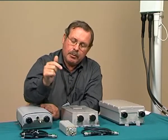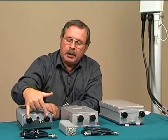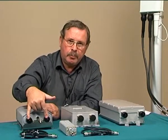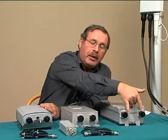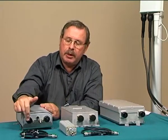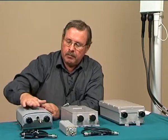The antenna cables that you'll be connecting from these connectors to the radio base station actually carry the DC power for these units, and this comes from the radio base station. So it's very important that you do not mix up these connections. There is an A branch and a B branch, and normally it's the A branch that contains the power and the data signalling between the radio base station and the unit.